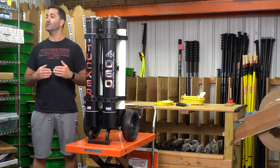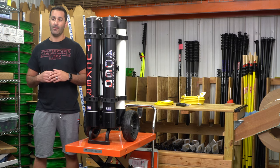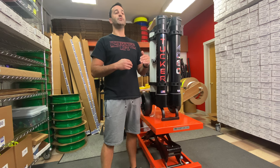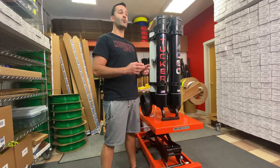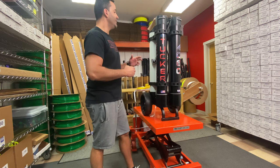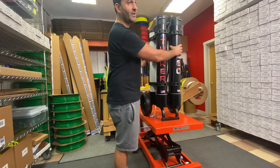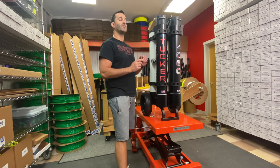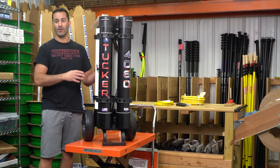What that means is you don't really need to use a pump — you can add one if you want, but it's not required. With the two ROs, you'll be able to put out about twice as much water as a standard single 40-inch RO system. These RO membranes, as well as the other filters — the carbon and the DI — are 30-inch inserts, so you have a total of about 60 inches of RO membrane.